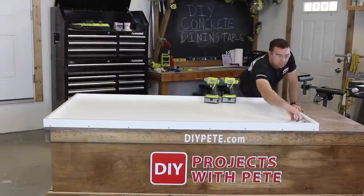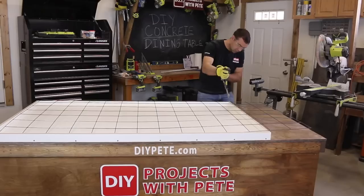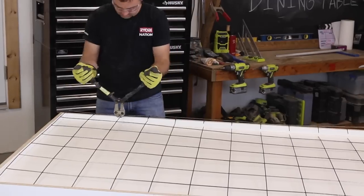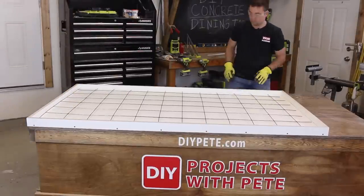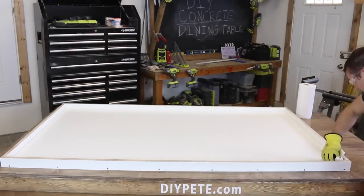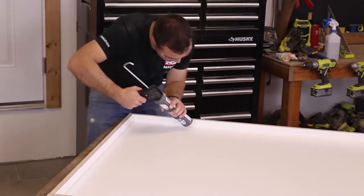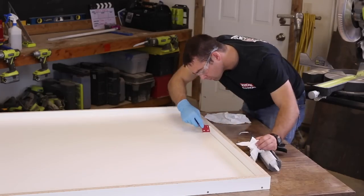Double check to make sure all four corners and the side walls are squared up, and then grab the steel reinforcement and cut it down to size using a bolt cutter. I like to leave a gap of about an inch between the reinforcement and the side walls around the perimeter of the mold. You may need to make some small bends in the reinforcement so that it lies flat. Then flip the mold to remove debris and use rubbing alcohol and a clean towel to wipe down the forms prior to sealing the edges with silicone. Use 100% silicone caulk around the seams of the mold — besides sealing the mold, it will give the concrete edges a slight bevel. Then use a caulk rounding tool to round over the bead and to remove excess.